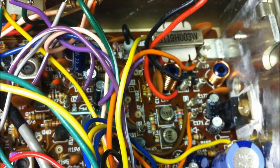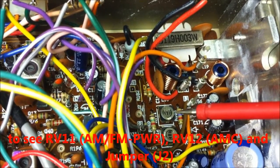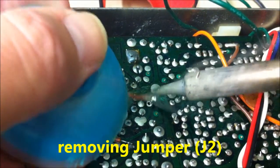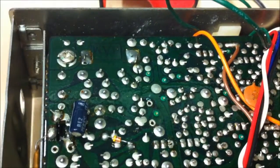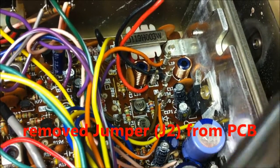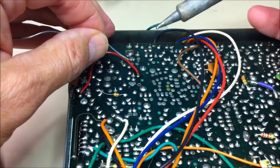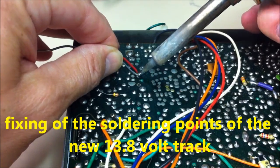This is the part side of the Multi-Mode 3. This here is RV11, the AM/FM power adjust, and this here is jumper 2. We must remove this jumper. One, two — and the jumper is removed. The jumper is here.